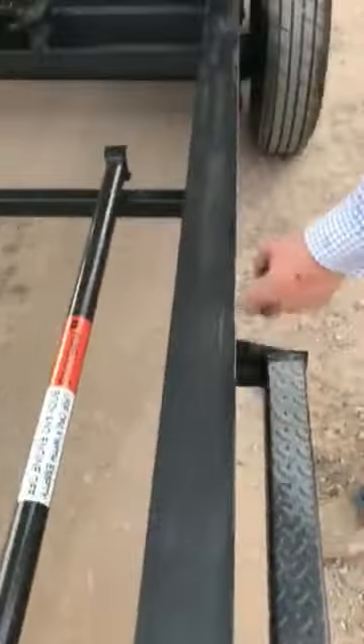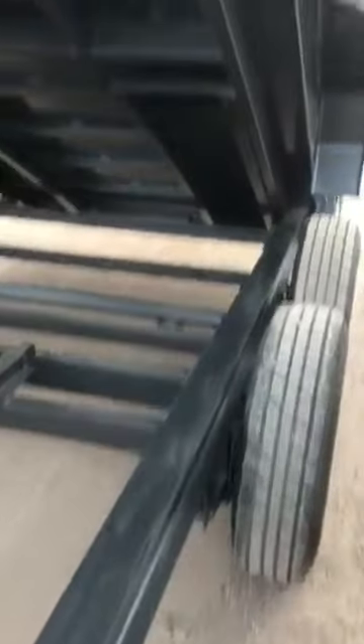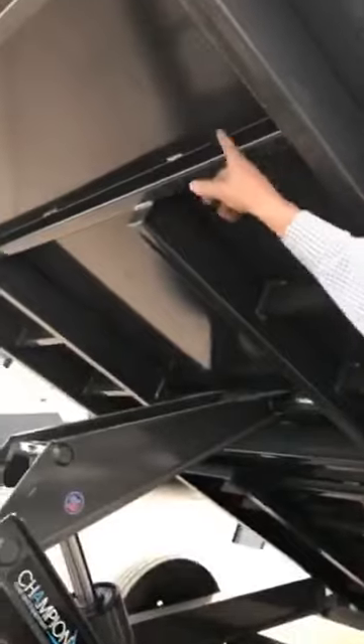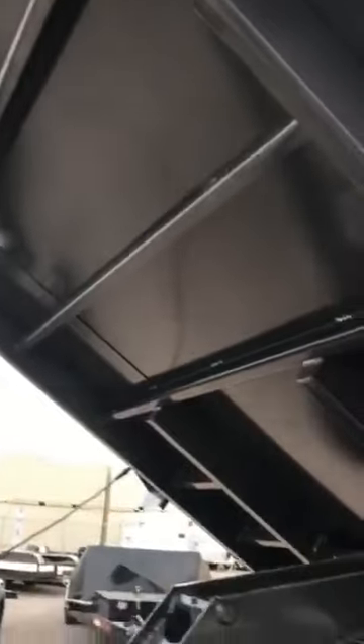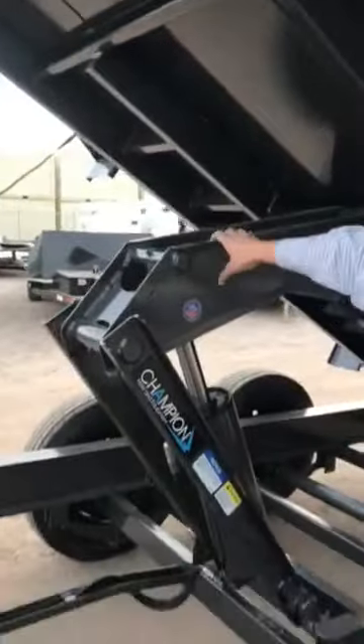As we come around here, the first thing you'll notice is this 36-inch sidestep that's completely welded onto the mainframe of the trailer, which is an 8-inch I-beam configuration. You've got this handy little hoist here just in case you ever need to do any service work on the trailer. You can use that hoist as you're disconnecting everything to keep yourself safe. As we come up here, you'll notice your 5-inch rectangular tubing as your mainframe for the dump aspect of the trailer, and 16-inch on centers with 3-inch rectangular tubing.